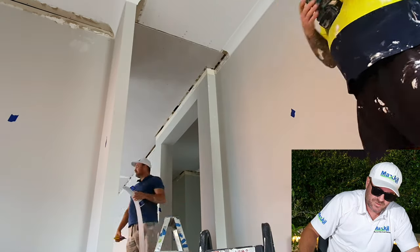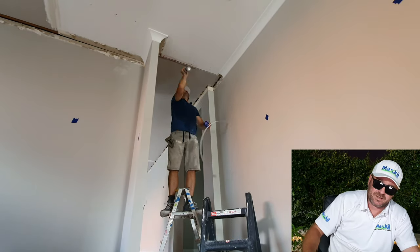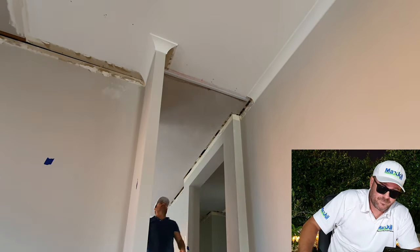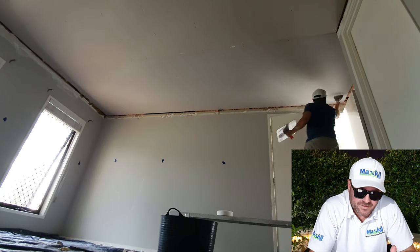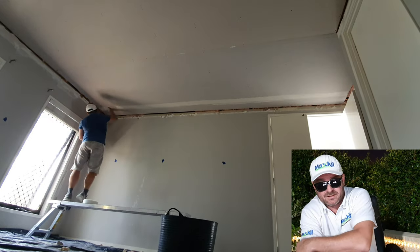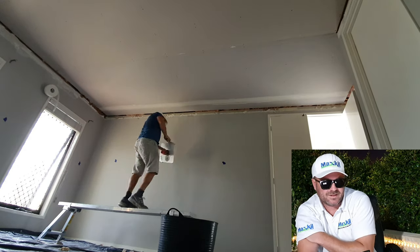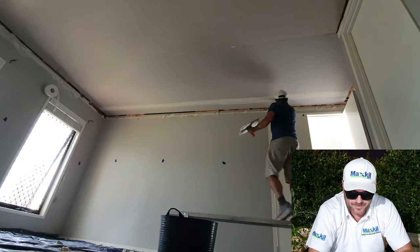Craig is chipping away a bit of cornice and I used the multi-tool with a straight piece to cut it back. I've got the expansion joint — it's the Trimtex magic angle. Just measuring it to size, making sure it goes through the cornice. Then I spray some Trimtex spray adhesive onto it, make sure it's straight — it looks good by eye along the hallway — and then I'm just stapling it in. Make sure it's all flat and one side is moving independently from the other.